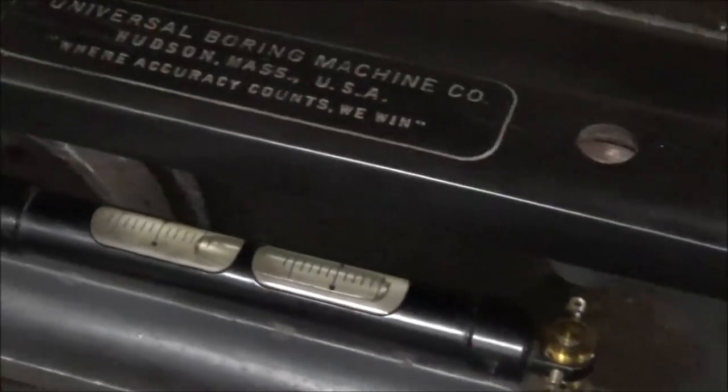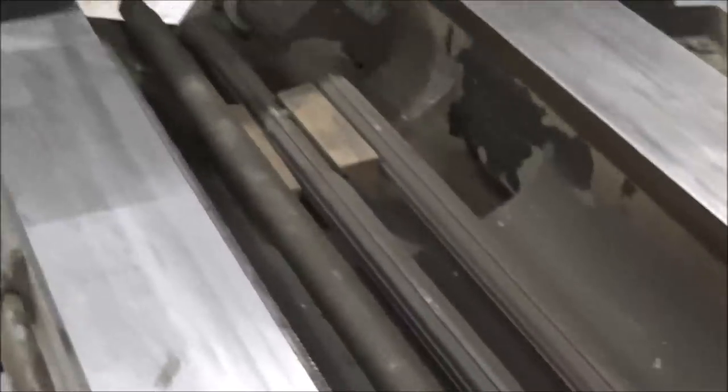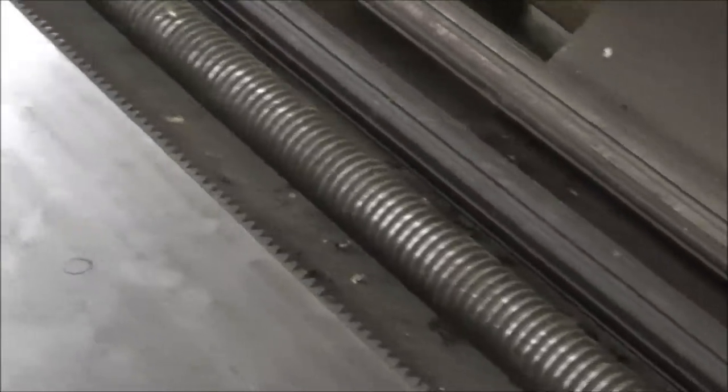But anyway, so we got, starting at the mill end. Now the mill is leveled so that there's no twist in the bed. Note that it's on the marks that I have calibrated the level to be level. And I've gone all the way down through there and I've got no twist. And I don't have any of the bolts pulled down, so I'm not forcing the mill into alignment. It's just sitting here. I could maybe improve this by yanking it down. But anyway, going down the side here, I'm over top of each bolt and in the center of each bolt.